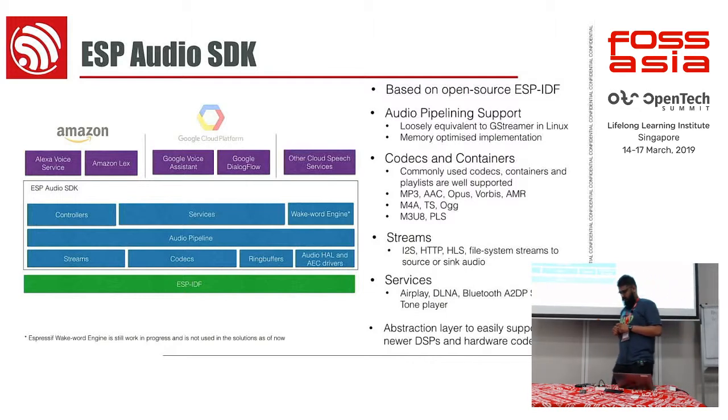If you want to put an Alexa or a personalized speaker together, you would typically go and buy a Raspberry Pi, which goes for $35. But if you really want to go to production and think about cost, microcontrollers will always cost less compared to a microprocessor — because the RAM is built in, the flash is cheap since you're not running Linux, and it's a very small constrained system with very few other passive components required, which is never the case with a Linux-based system.